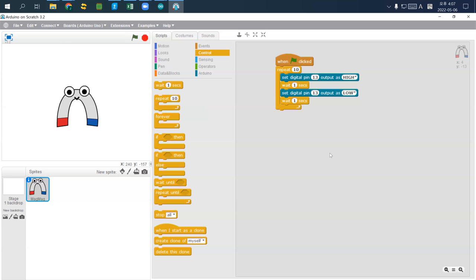And probably your Arduino, your LED light will blink. What it means is that pin 13 is connected to the built-in LED. So let's see, you need to check here that the white one is connected to plus and red is connected to minus. The white goes to pin 13. So it's here, okay, that's perfect. Okay, so here.